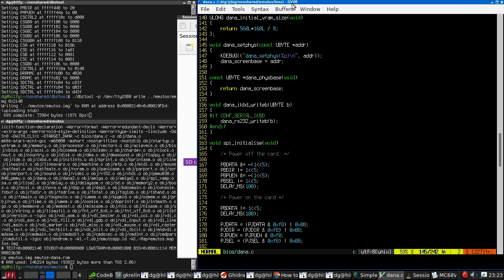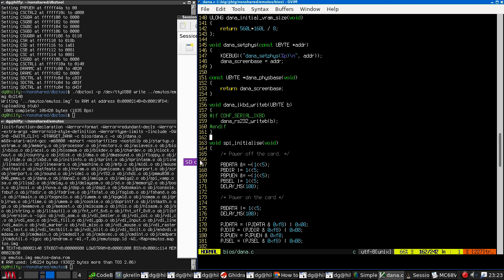Doing lazy releases of chip select allows you to do things like do deferred writes, where you send the data to the card, and the card thinks about it as it erases a sector and programs a sector if necessary, before the write finally completes. And if you can do that in the background while your program is continuing to run, that's a good thing.